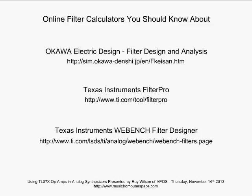Our final question is from Nathan. How does your integrator output differ from a comparator with the voltage set at peak? Well, the integrator's output will eventually ramp up to V saturation, or it will ramp down to negative saturation of the op amp, but you try to keep it from doing that. Once the integrator has ramped up to V saturation, it's no different than the output of a comparator that is also sitting at V saturation, but the function of the two circuits is quite different.